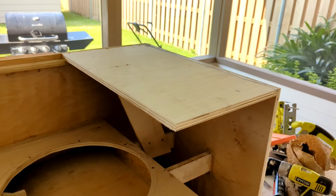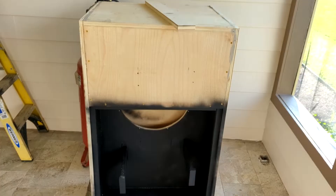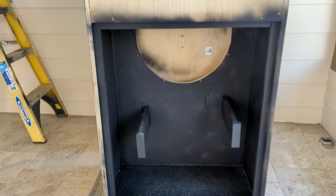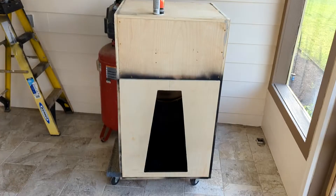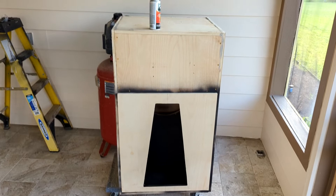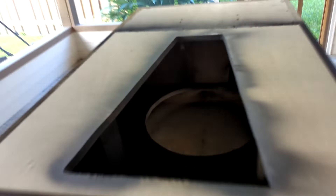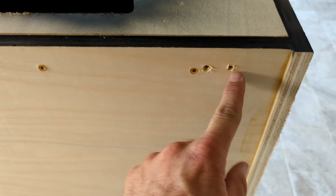You're going to want to go ahead and do some painting. I just use some cheap paint primer and flat black — you just want to cover the inside that's going to be showing. The rest is going to get Duratex. They are complete structurally — still ugly as hell — because I just finished doing a little painting on the inside. All the boards that will make a difference, the edges of these boards, just got a single coat of cheap black paint. I still need to do some work on them but next up I am going to use Bondo to fill all these little screw holes, then sand off all this glue, and then roll on the Duratex.